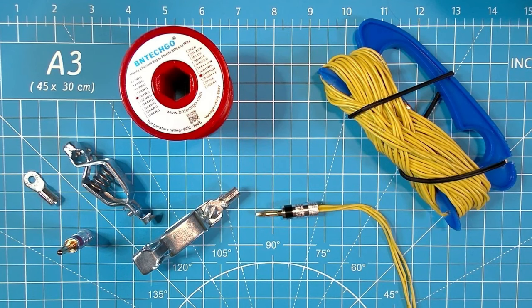But we also know that if we ask two experienced hams what the correct ground radial length is for a vertical antenna for portable operations, we would get 7 different opinions. If you want to find out what your radial length should be, start with the manufacturer's recommendations of the particular antenna system you are using. DX Commander is known to have some excellent material on ground radials. Investigate his information. K8MRD has been doing some really great videos on this topic. I have recently been using 16.5-foot radials on both 20 meters and 40 meters single sideband voice.